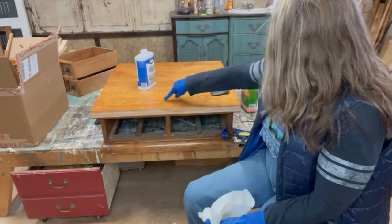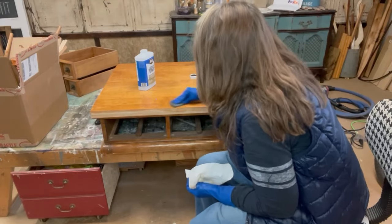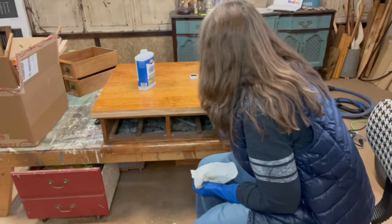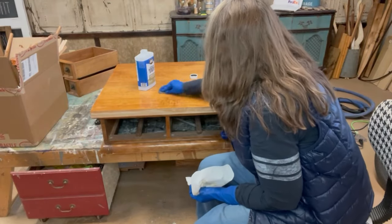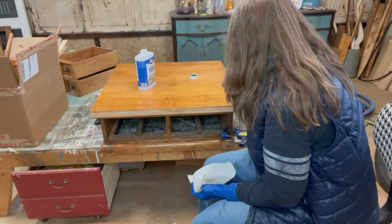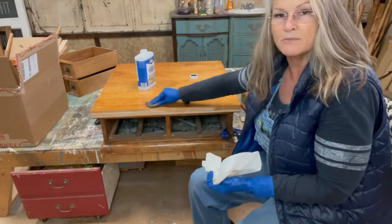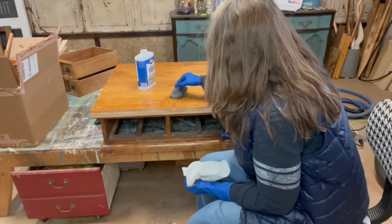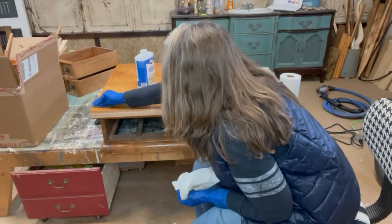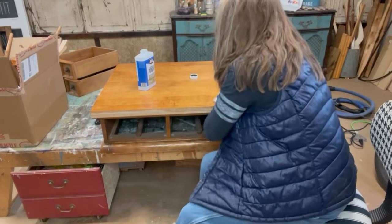There is a little bit of a stain on this wood. It looks like maybe somebody put something wet on it. I'm hoping that I can sand that down. If not, it's just going to be the character of the piece, and I'm going to embrace that. I'm okay with it. So we get all this cleaned up. After it's clean, I'm gonna get a 220 grit sandpaper. I'm gonna smooth it over and get ready either for stain or wax, or I don't even know at this point what we're gonna do, but we're gonna do something. And wipe it back. Yeah, that's looking really good.